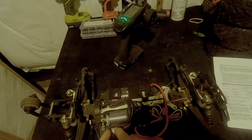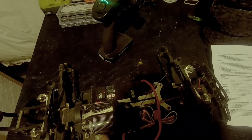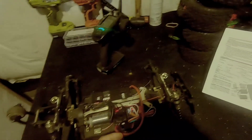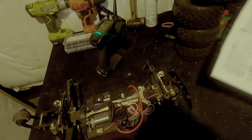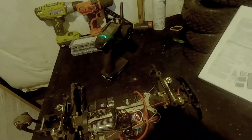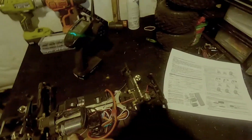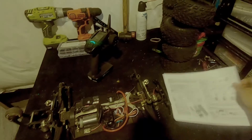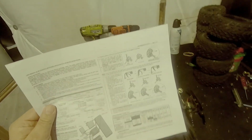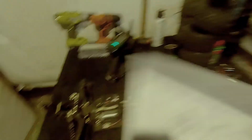What you're going to do is hold down the set button, turn it on, and wait for some green flashes. There's one green flash — if I stopped it there I'd be in running mode, and it's flashing two reds which means it's in the second setting for running, which is reverse, forward, and brake. I don't want to be in that mode so I'm going to shut it off. The modes I want to be in are three, four, and five — so the first one's going to be low voltage cutoff, and I'm going to change that to six, which is 3.4 volts per cell.